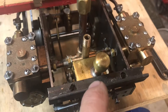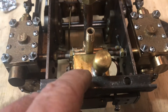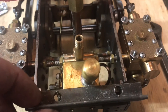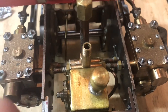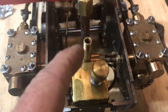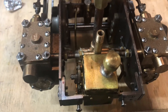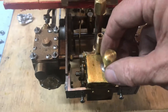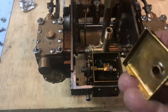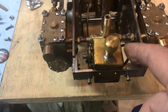Playing around with some solutions — one thing I could do is live with the offset oil filler here, which is not that unusual. Most bigger locomotives have the oil filler completely over to the side. I put a little piece across there as an illustration, but I think that would bother me. Plus it would still be somewhat close to the saddle. So I'm going to stick with my original plan and completely reverse it. I will have to put a notch in the buffer beam, and I'll also need to put a matching notch on the cap for the ratchet mechanism on the other side.